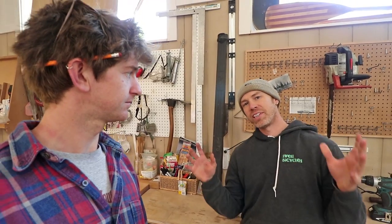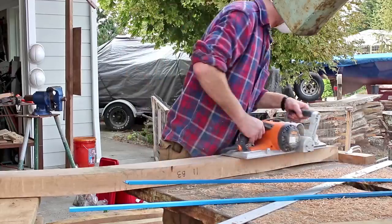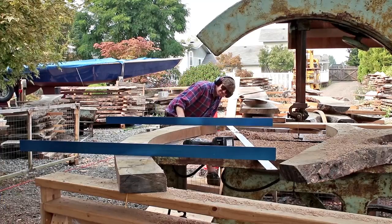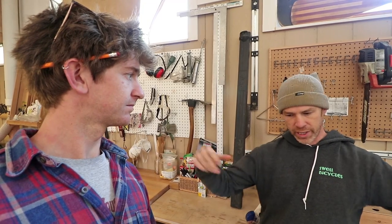The pieces of wood that Leo's got here are generally very big and very heavy. When a piece of wood's that big, you can't run it through a tool like a jointer. You actually have to set the piece of wood down and then run a tool over it. And typically the way we've seen that done is people using router tables that are usually just two rails and a router jig, clamped up temporarily in place. But since we're doing such a huge volume here, we're thinking that we might want to use his 7-inch planer. It's going to be a more complex design.